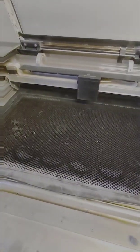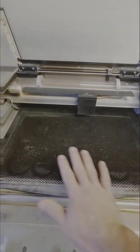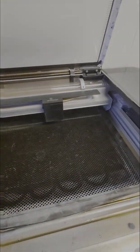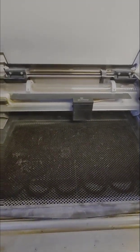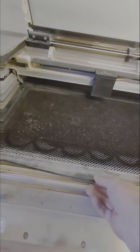First, a couple of things to check while you're in the shop. If your material is not flat, the Glowforge can't cut — usually the sign is that it's cutting at one end and not at the other. Your crumb tray has notches that it sits in underneath. If it's not in those notches it won't sit flat, so one side or the back could be higher. To seat it in the notches, pull it all the way forward so the lip is hanging over, then move it side to side until it drops into the notches.